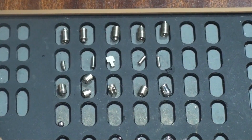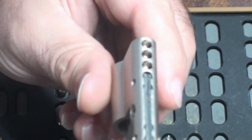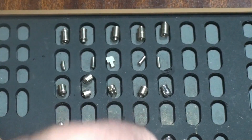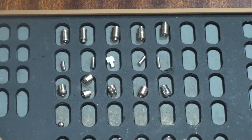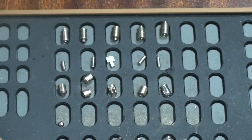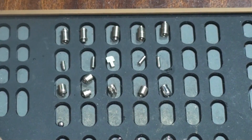It's an easy beat in terms of picking, so low picking protection, but it has got good anti-snap protection, good anti-bump protection, and good anti-drill protection. It's flexible in terms of master keying, and there will be a lot of different profiles available for different geographical areas for this as well. So it is a good basic bottom of the range offering from Mul-T-Lock, and I personally think they've done a bloody good job. So there you go.